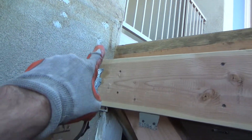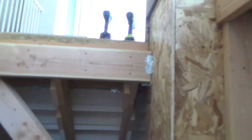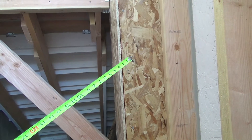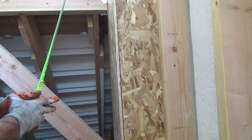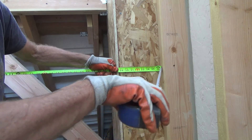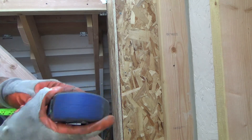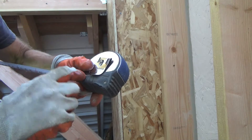Here's one last thing. I got a measurement from the stucco on down — and it's really hard to do that when you're running your tape measure into a corner. It's hard to see exactly what that measurement is. That's why I say when you look on your tape measure — on this one it said plus three and a half, and I saw it right in here.